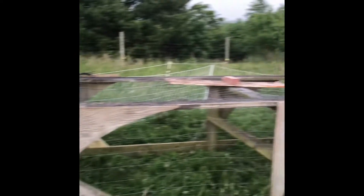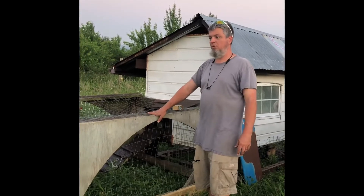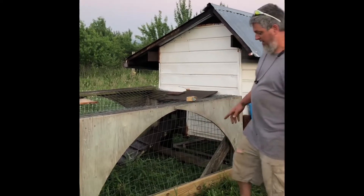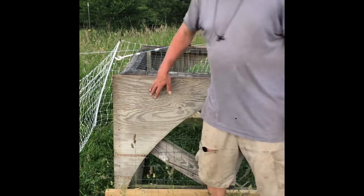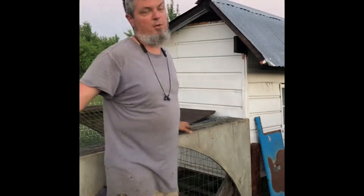This is our old run — it's like 12 by 5. We used what we had. These are boards off of an old porch that somebody in the family ripped down, and we had to brace it up so we fixed this. We ended up putting some GRK-type screws in around here because the galvanized nails I had originally built this with were pulling apart. This coop is 10 years old.